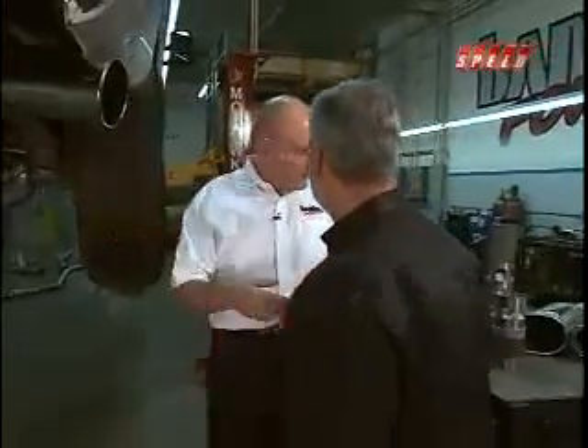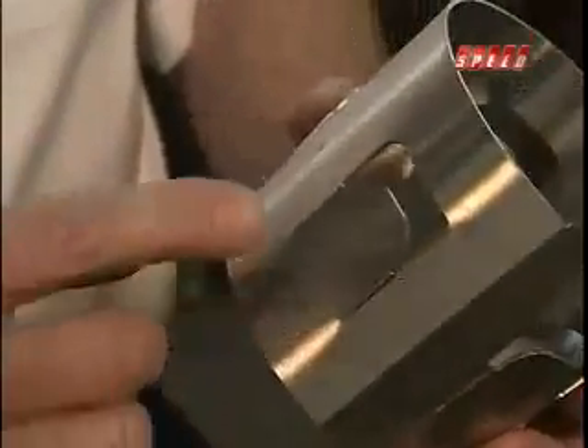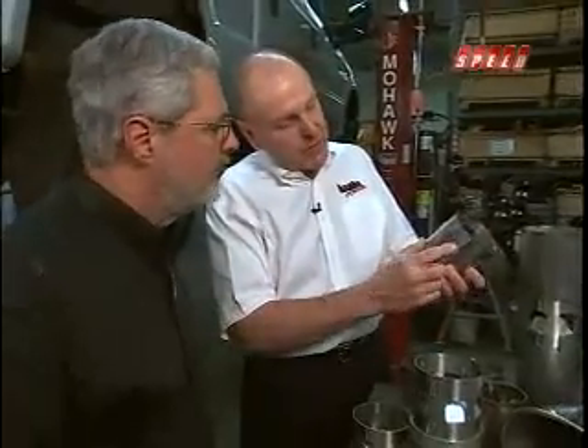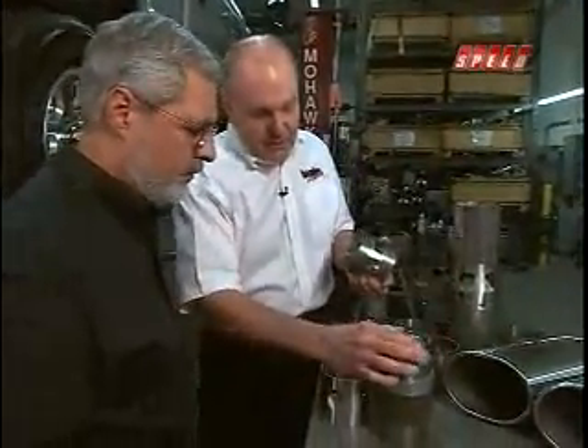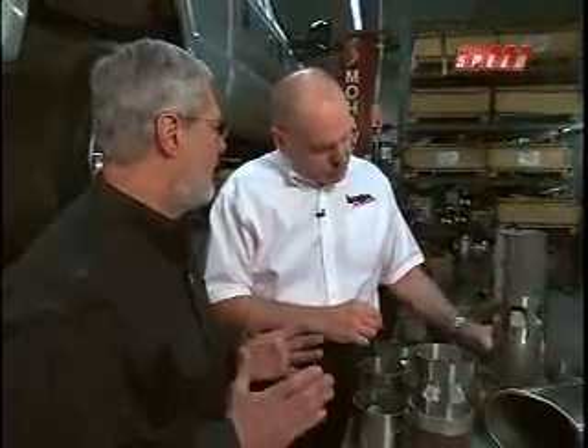So that's the cool cuff. How is it made? We generated the shape of the air inlets in the computer — it's not just stamped and then bent in. We've got a unique shape here. Then, using this engineering die, we bend them in to the correct angle as dictated in the computer design. All of this is validated by measuring in the field — trial and error.